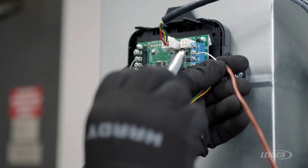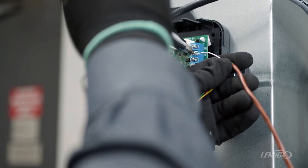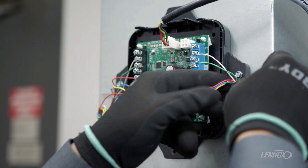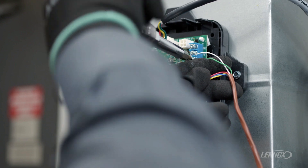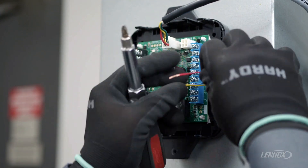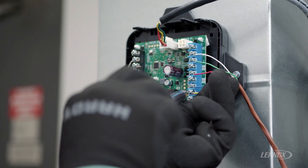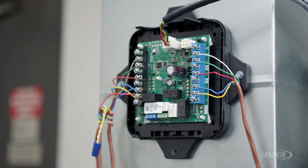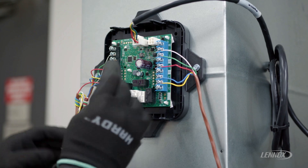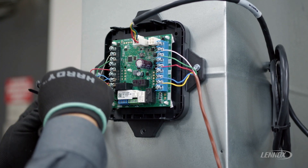This step will be wiring the furnace or indoor unit to the RDS control. The indoor unit wiring to the furnace is connected to the right side of the RDS control, or blue terminal strip. It must be connected to this side to ensure the RDS functions properly and provides mitigation in the event that it detects the presence of refrigerant. The next step is to verify the wiring and then neaten up the wiring before you move to the indoor furnace connections.